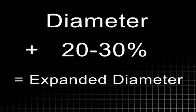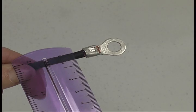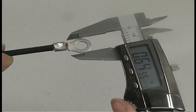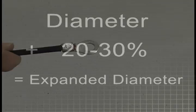If you're not using a caliper, lay your ruler over the top and read the diameter. This is the size that you want the tubing to shrink down to, also called the recovered diameter. If you have any connectors to cover, measure the diameter of the biggest obstruction and choose tubing with an expanded diameter that is 20 to 30 percent larger than this number.